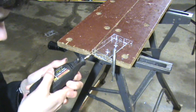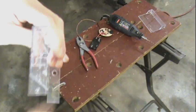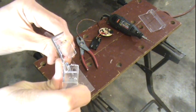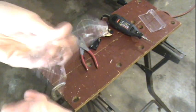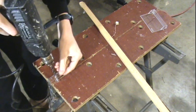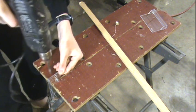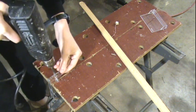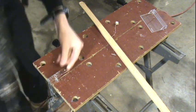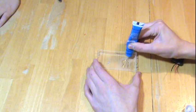Now it's time to get out the drill and Dremel and start cutting. You must be very careful with the plastic, because one false move and it will break, making you restart the whole process over again. It took me about five or six times to get it just the way I wanted it, so it's going to take a lot of patience. After all the holes for the switches, LED, headphone port, and volume are in place, I went ahead and used some glue to attach the headphone port and battery holder. Now let it sit for a while.